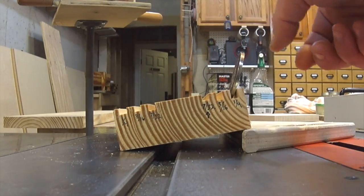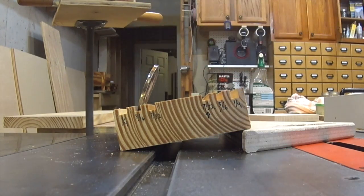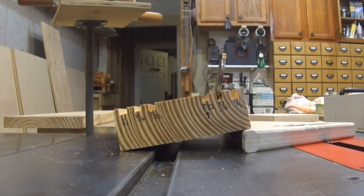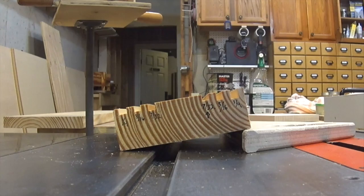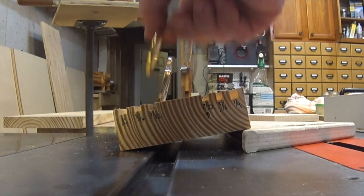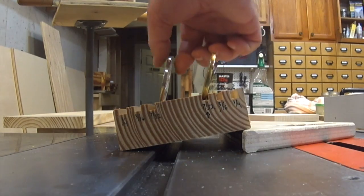Now it's time to cut the grooves the coins will sit in. It may be counterintuitive, but I've found that the grooves are better suited perpendicular to the top of the display instead of perpendicular to the table or desktop the display will be resting on. Because coins may vary in thickness, cutting a wider groove that allows the coin to lean against the back edge of the groove is more secure and consistent than a groove where the coin will have to either balance to be straight up or lean too far back. This makes it easy to cut the grooves on the table saw.